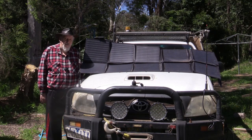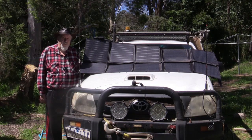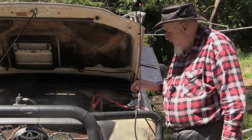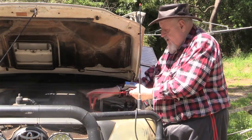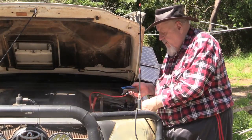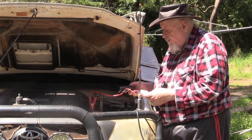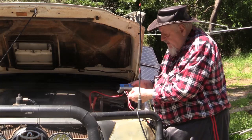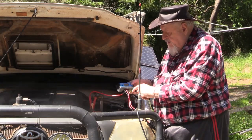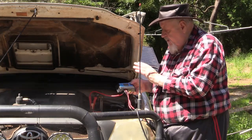It's worthwhile having an amp gauge on any solar panel at any time so that you know whether you're getting any current into your battery. The way I've set this up — it's a small regulator setup and you can clip it onto your main battery and charge your system. I've added Anderson plugs to it, which weren't on it originally. On the output of the regulator, which you can turn on and off, I've got a little 12-volt light bulb to show that I'm getting power into the system and it's working.